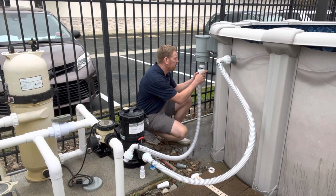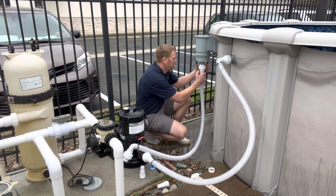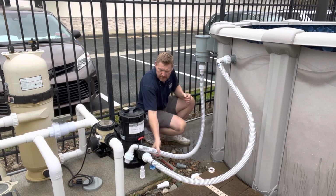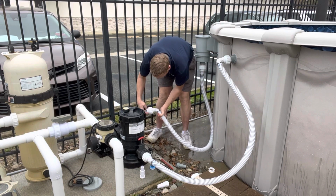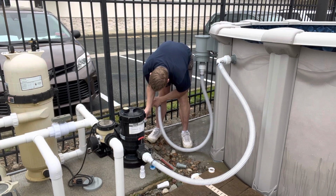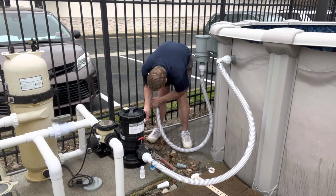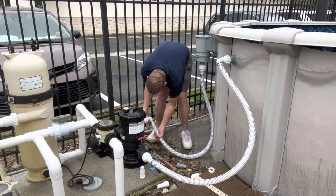So you just put that on with Teflon or marine grade silicone, both ends, all the threads. All right, tighten that. Then on this end, see, that's where this elbow makes connecting to the pump easier. Now you could have had a straight end on it, but either way, it puts less stress on the fitting and on the pump head.